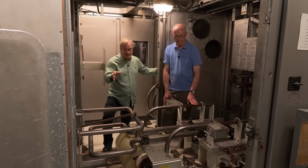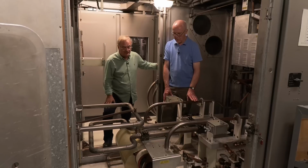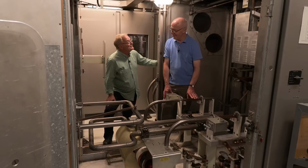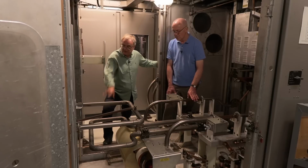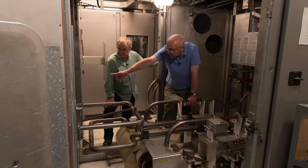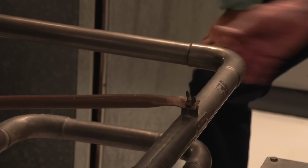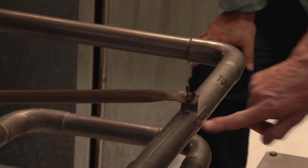And finally, literally, we're at the final stage of the production of the carrier here. When you look in your transmitter at home, if you use a tube transmitter, you have some wiring from the final tubes. This is the wiring here, but this has to be fairly substantial, doesn't it? Yeah, this is nickel-plated copper. Wow, so we've got the 2 final valves, tubes there, the coils bolted in across there. This is an 11 meg output coil. So this is like pipe work. Yeah, nickel-plated copper. And there's the HT center tap, right on the center of the coil.